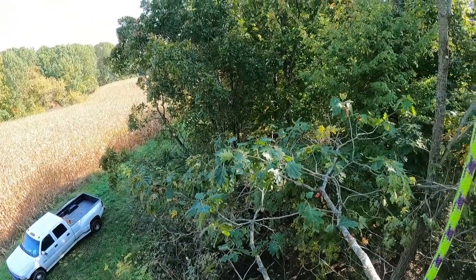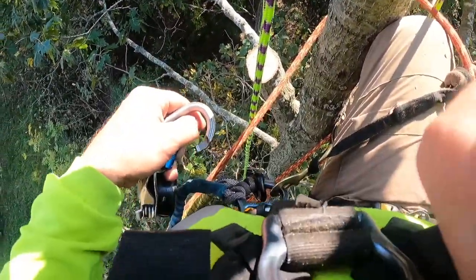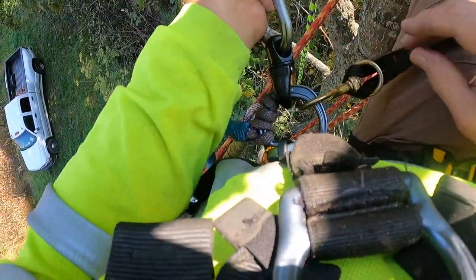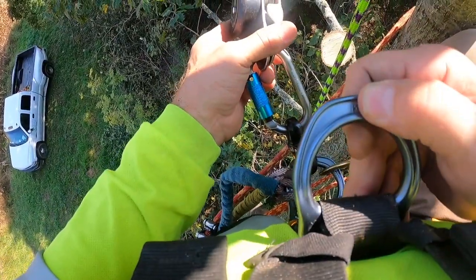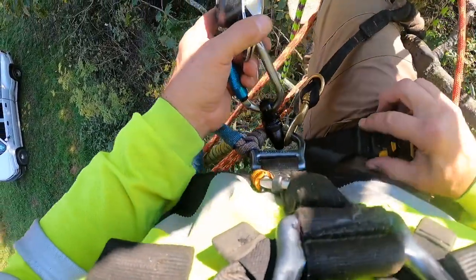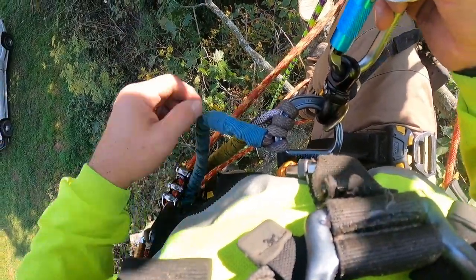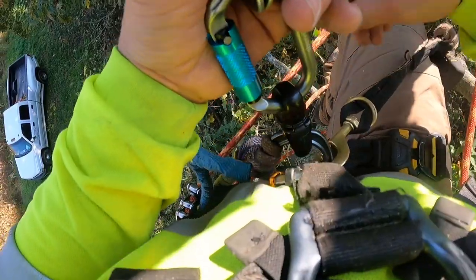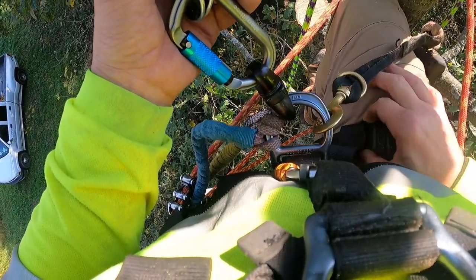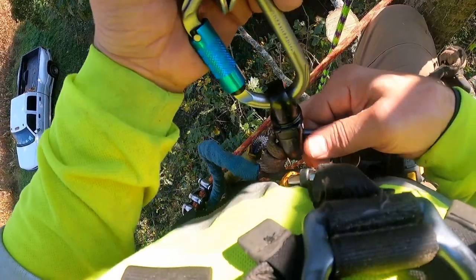Now for the benefit of my friends in Guatemala, I'm going to set a rig. I've got a Petzl full body harness — it's a full body harness with a chest attachment. I'm going to experiment with a clevis in this attachment point here, and run from this point to the point on the other leg and run a bridge. So I can run a bridge on here, and I'll probably put a second tether to this D-ring since potentially the manufacturer wouldn't authorize a bridge to be solely on here.